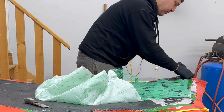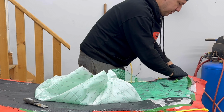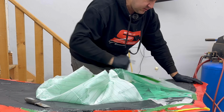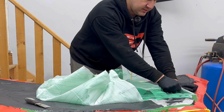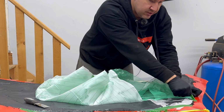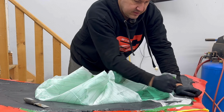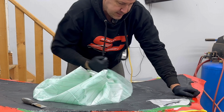Actually too bad under there. So the hood won't be stiff yet. This resin is a very slow resin. So it's 36 hours for full cure. Plus it's cool in here. It's probably more like 40 hours, but I'm not wanting to wait to see what it looks like after the vacuum pump died.